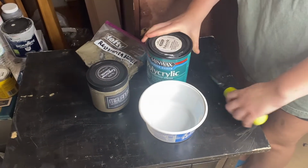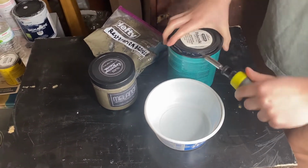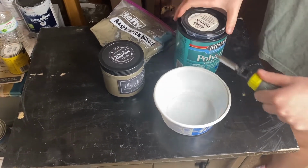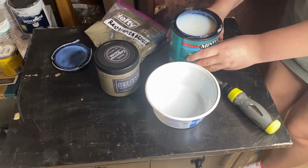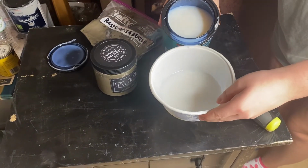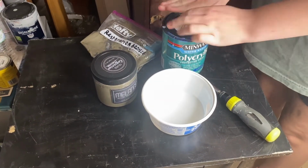After the paint was dry, I prepped for top coat. I like to use water-based polycrylic in the clear matte. You will see that I'm putting a bit of that into an old container and then taking the tip of my brush, putting that into the paint, and then transferring it over into my top coat and mixing it. I like to do this especially on dark colors to minimize the cloudiness. You just want to make sure that you mix it in really well and not use a lot of the paint. A little bit will go a long way with the top coat.